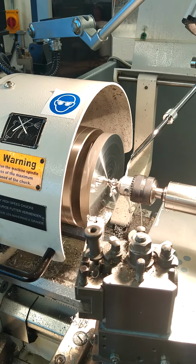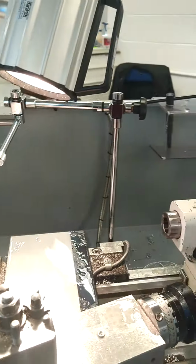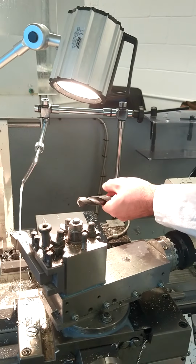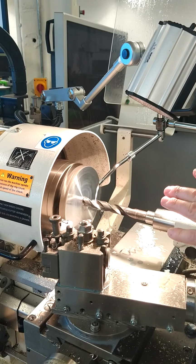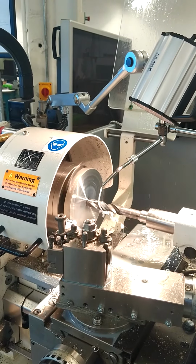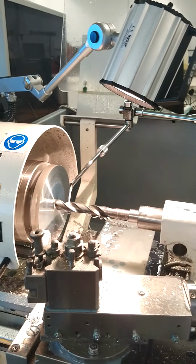We've done that now, and now we can replace the chuck by popping in our 19.5 drill bit. Again, calculate your speeds for the 19.5, but as you're in training, we're going to leave the speed today at 540 RPM. So powering on the lathe again, applying the lock, and you're drilling in. Important here is to keep drilling, don't pause. If you pause, you get a high-pitched screech. So as you're boring in, you're going straight through. But don't pause, keep drilling, keep feeding on the tailstock to avoid that screeching noise. The 19.5 is drilled.